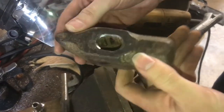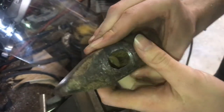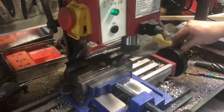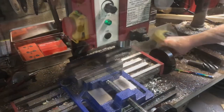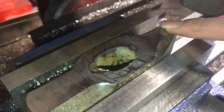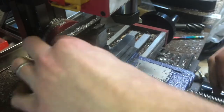With that out of the way, it's starting to look like we can do something with it. You can see that milled slot and we did get rid of some of that weld bead — it's almost the perfect size and position, so that's pretty good guesswork. Most hammers have ground finishes, but I kind of want to try this carbide tooth fly cutter — maybe it'll leave some cool machine marks. It didn't touch all the way down over here but I think it's a cool finish; most hammers don't have machine marks like that. The surface finish down here is pretty nice.